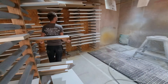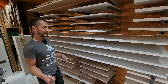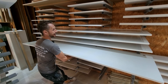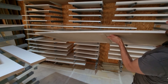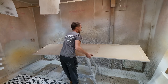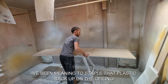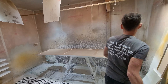So these are the shaker style doors — they are giant. They're just over 600 wide, about 2.5 metres tall, so they're oversized, they're huge. But we make them with a 12mm panel and 6mm add-on strips, and that way we just keep it lightweight. If you're making them with 18mm or any other method, it's going to be super heavy.